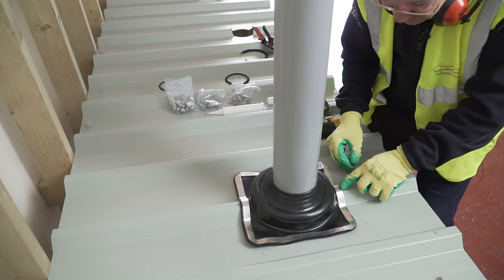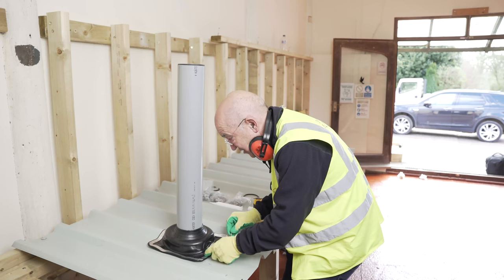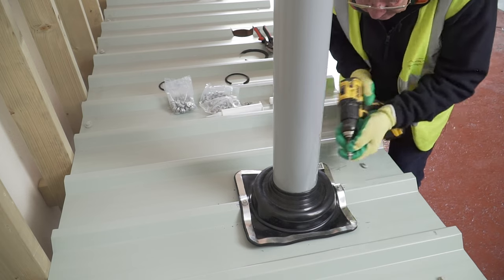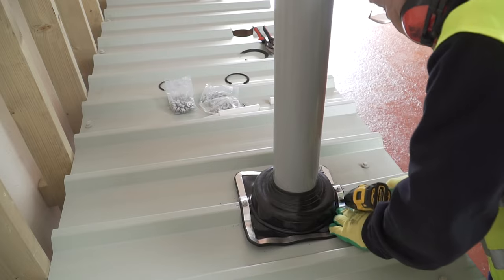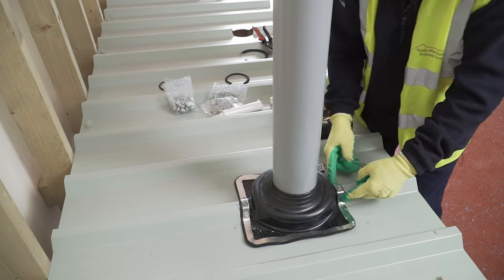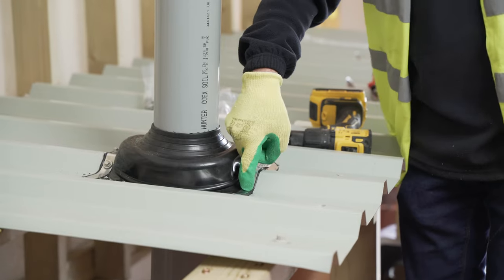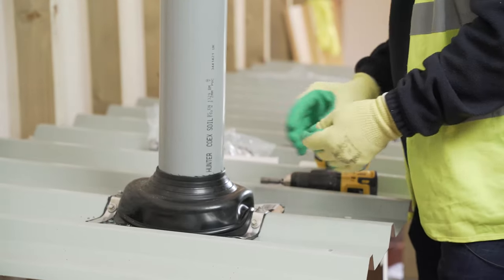Make sure you're in the centre of the metal strip. There are ridges underneath the metal strip that sit into the mastic. I would go halfway down the upstand in the middle of the silver strip. So I've fixed the top first, then worked around — that pulls it in tight. When going around the sides, be halfway up the incline; don't go down the bottom because there's a hole there that could leak. Keep fixings about 25mm apart because it needs to pull in.